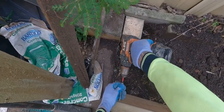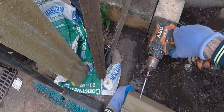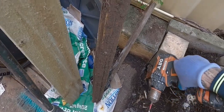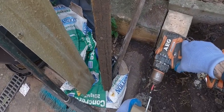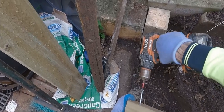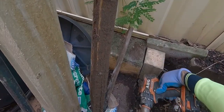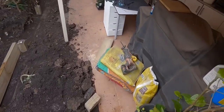Next day. So here we are just tacking off the sleepers. So what I do, I actually lately have been using a drill, mainly because I set this post one day before, so I didn't want the vibration from impact drill wobbling the concrete, making the post become loose, because that will happen, especially after one day and no curing. Plus it was quite overcast and sort of wet the next few days, so had to do this. Plus, I like it. I don't want to hear the Ugga Dugga noise all day long.